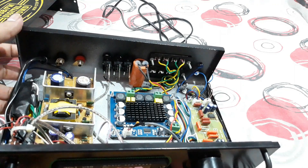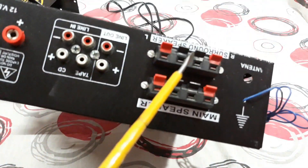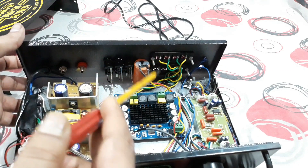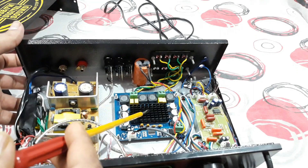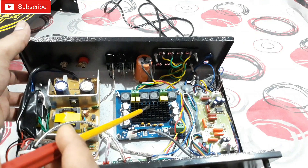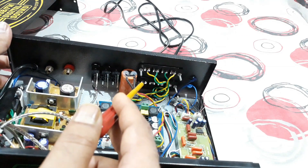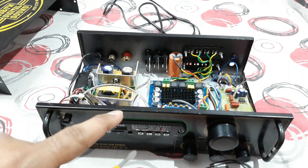The other RCA inputs are not connected, and in the speaker section I've connected only one pair of speaker sockets. The reason is that in all these kinds of amplifiers the terminals are parallelly connected, so if someone connects two 4-ohm speakers to both terminals the total impedance would be 2 ohms, which is not good. This kit requires at least 4 to 8 ohms — using below 4 ohms will burn the amplifier chip. The backup terminals are available if needed.